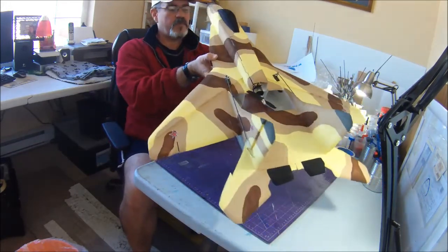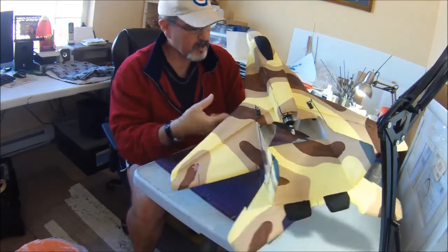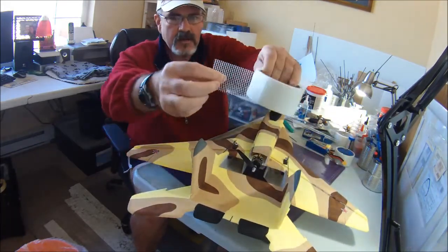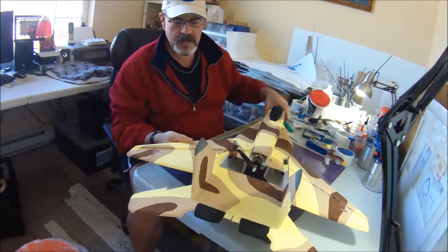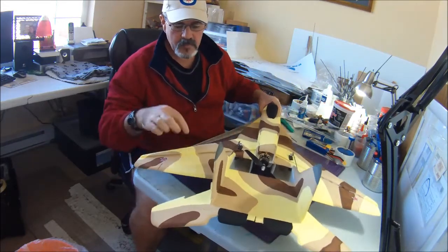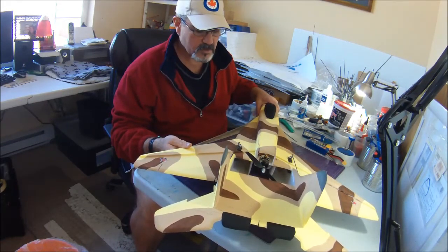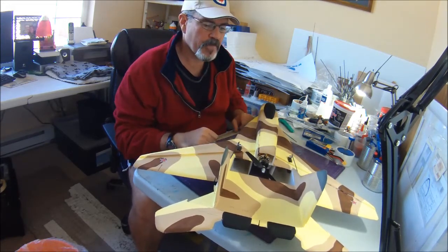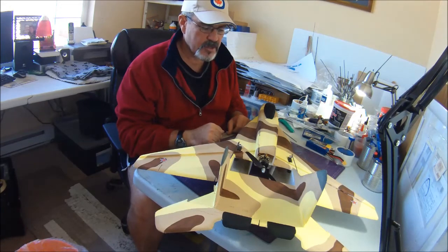But a lot of people now like to use this fiberglass mesh drywall tape. You're probably not going to be able to see it here, but it's sticky on one side. I'm using that for all my hinges and a lot of my internal reinforcement. Because this is acting as the hinge material, the glue doesn't really need to hinge. When it all completely sets up, it sets up about the consistency probably of epoxy. So it dries pretty stiff and solid.